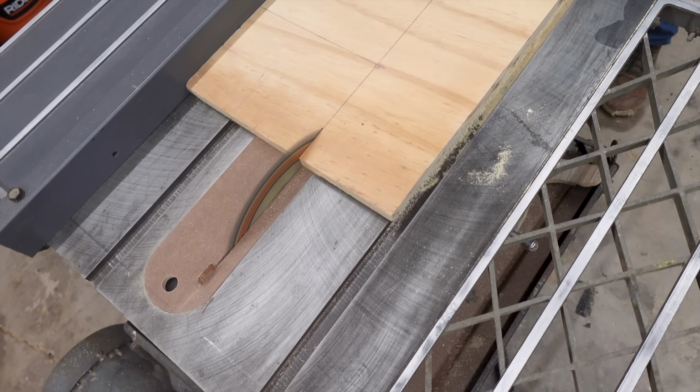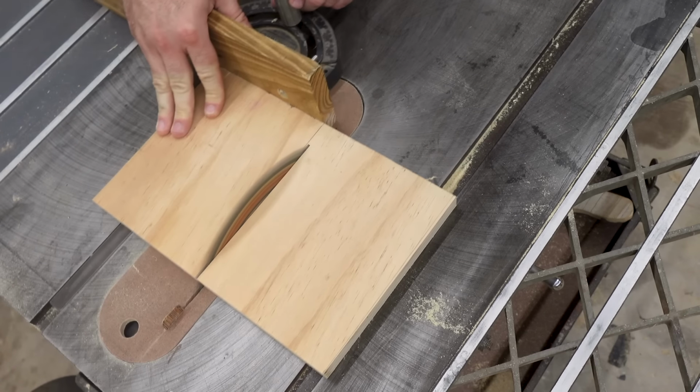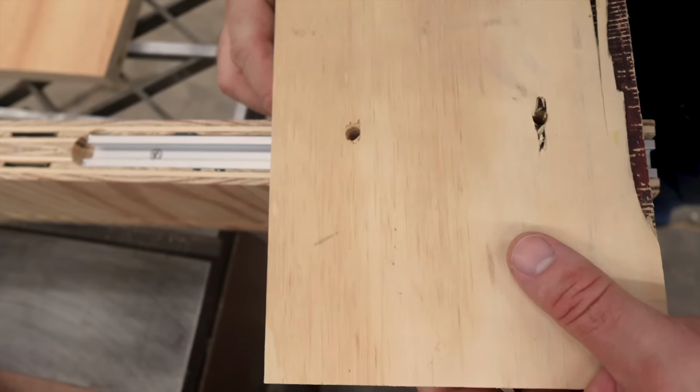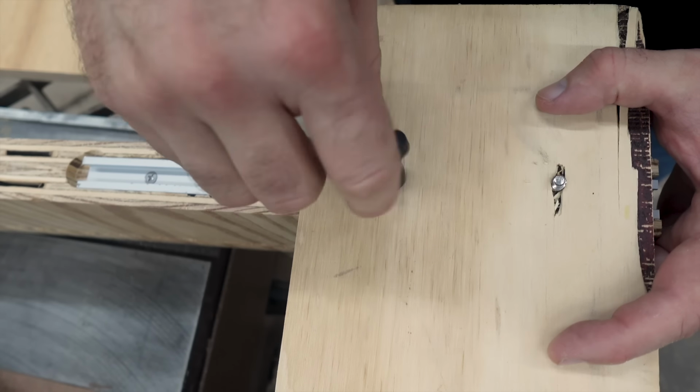Okay, now that we have a fence extension, I'm going to make in-feed and out-feed supports. Now these couldn't be simpler. Just cut some rectangles, making sure they're wide enough to overhang the side of your fence by at least a few inches. Then drill some holes in so you can slide in bolts that will go into the T-tracks. And I love these knobs, but wing nuts would work too. By the way, I'll link to all these hardware pieces in the description below, so don't worry, I got you.